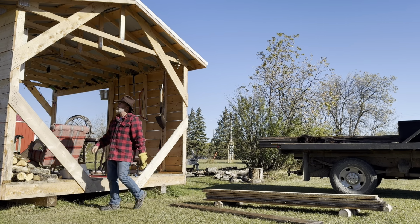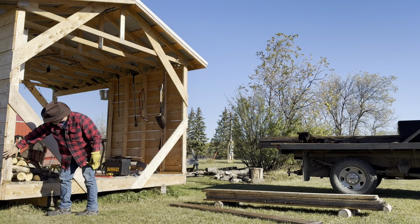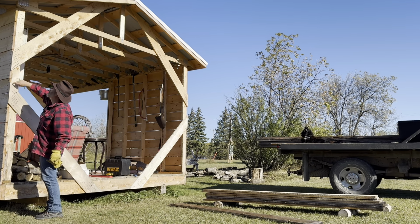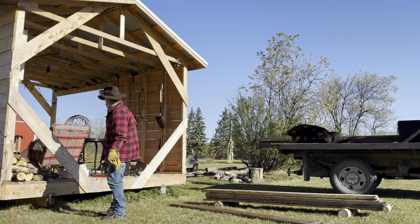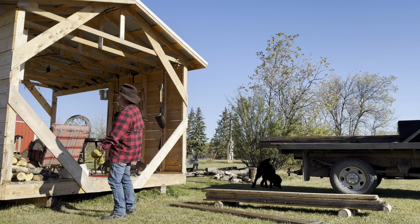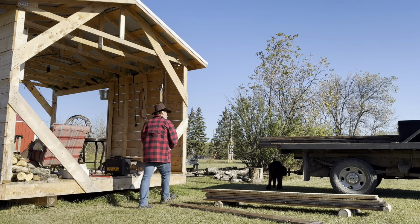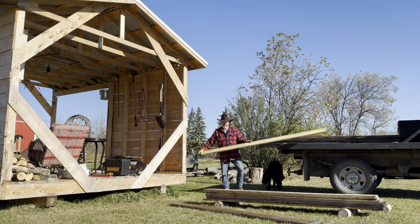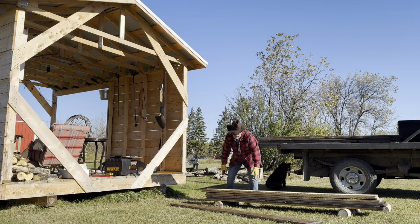So if you can see, because this brace and this brace is elevated, what I'm going to do is put strapping here, here, a piece to the top on both sides, and then put the board straight across like that, just to match this look here. Okay.